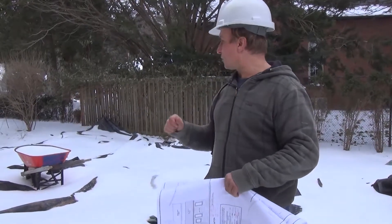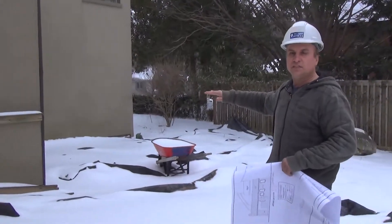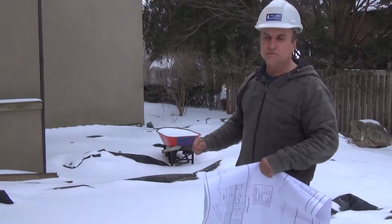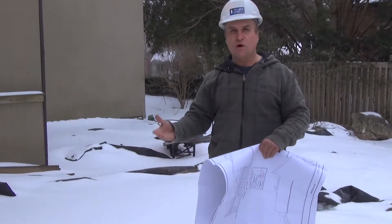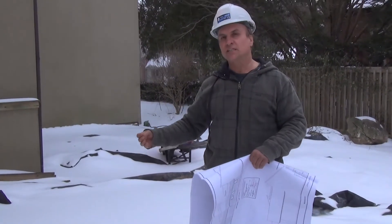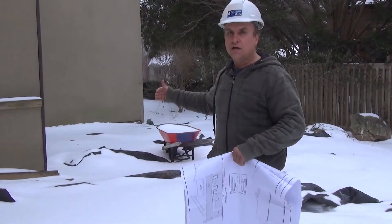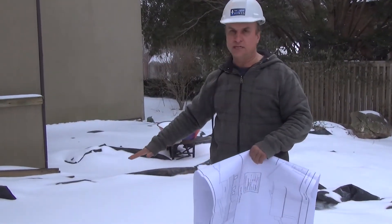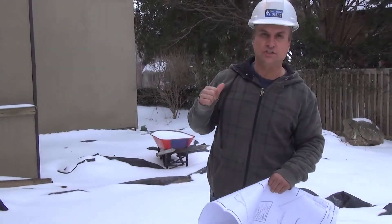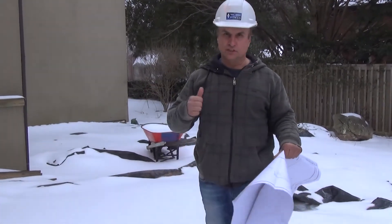The one thing I'm a little concerned about is we're not sure when we excavate next to the back of the house where the garage wall is. Sometimes you'll find that the garage wall footing is at a different elevation than the basement. If that's the case, we may have to underpin the wall that's higher than the basement level we're going to be digging at. We'll see what happens tomorrow because we're not sure what we're going to get into when we dig that out. We'll see you in the morning when we're excavating.